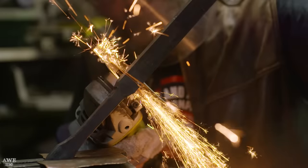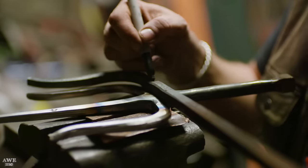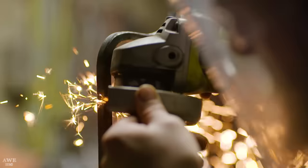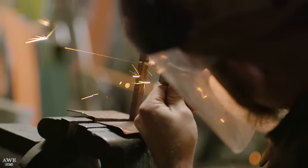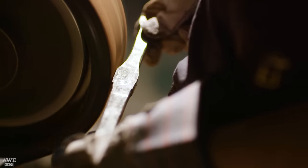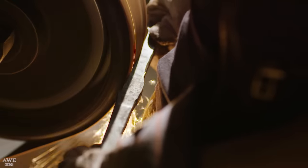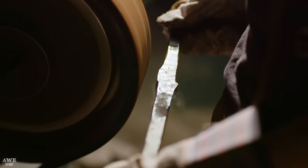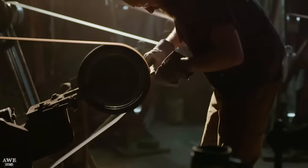After forging, I'm just gonna use a whizzer to remove this material from the bar, and then go straight to the sanders and true up my handle portion. My main goal is to define the pommel area and to smooth out the transition where the two side pieces are going to be attached. The big advantage of doing this type of construction is I can completely clean my parts before they go together. I don't have to do much on the slack sander afterwards.